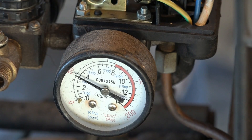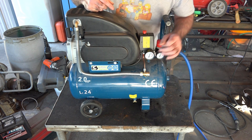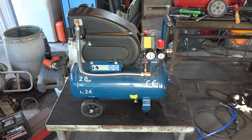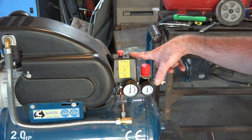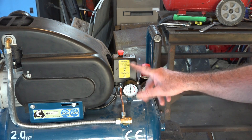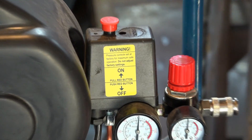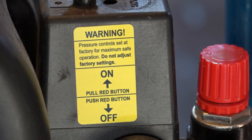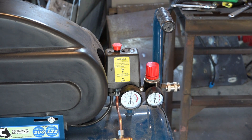I don't know which sort of compressor you fellas have got, so here we have this sort of compressor — it's a lot smaller and it's pumping up to about 100 PSI. It takes a lot longer to fill the tank because it's got a little pump on it, but I'll show you how to adjust the pressure on this one. I'll just show you something first — don't say Pete never shows you nothing. Now you see where this is all factory set. There's a big reason why manufacturers don't like you playing with this — not only might you blow yourself to kingdom come, but you'll burn out the compressor a whole lot quicker. It says: 'Warning — pressure control set at factory, do not adjust factory settings.' So there you go. But Pete's going to do it anyway. I advise you not to do it, but I just want to show you how to do it in case one day someone asks you.